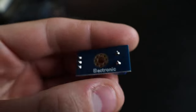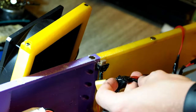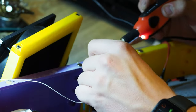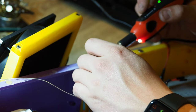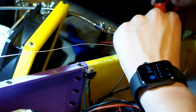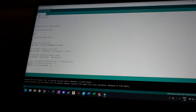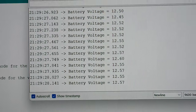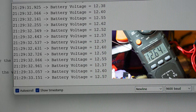To install the meter, I had to steal a connection off of the main batteries, which ended up being a bit more annoying than I thought, because I was lazy last time when I made the electrical harnesses and I used electrical tape instead of heat shrink. This left a really nasty black residue that I couldn't actually solder to. After some trial and error though, I was able to get through and solder on the wires. After I spent a little bit of time stealing someone else's code off the internet, I was able to get the voltage printing out in the COM port of my computer, and the reading actually seemed pretty accurate.